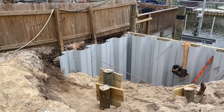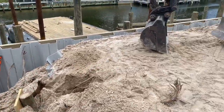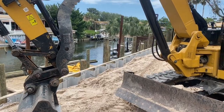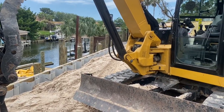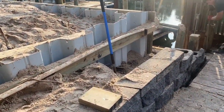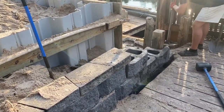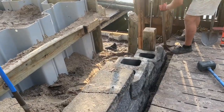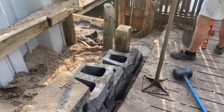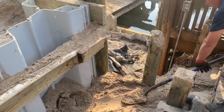We've got all the vinyl sheet pilings in. We've got the dead men installed — the tieback system. We've got a lot of the backfill installed already. Now we're going to go ahead and get the excess parts of the pilings cut off, and the long ones we'll cut those to 40 inches for a handrail. We've got a return wall installed on the neighbor's property. We ran a 16 foot return wall back to prevent any erosion in case the wall next door fails. We had some block walls that had to come out of the way because when we excavated, they all started coming down, so we're trying to get the neighbor's wall put back together properly.